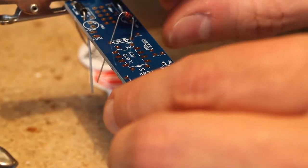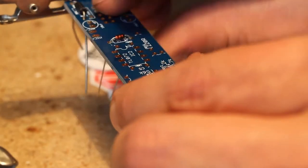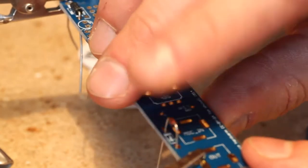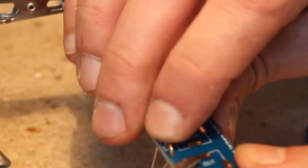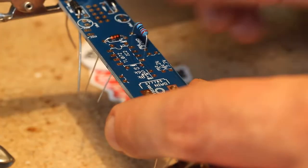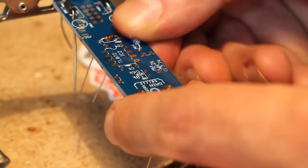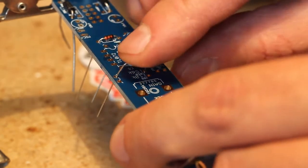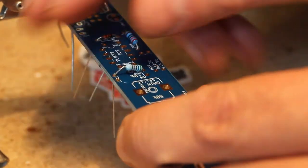Mikrophonie is already a classic DIY module. It's one of those really simple and obvious ideas I wish I'd had. And it's a great beginner project. It's just a microphone preamp with a contact mic soldered right onto the panel. It also has an external input that disconnects the internal mic when you plug in your own mic, hydrophone, magnetic pickup, or whatever you'd like to amplify.